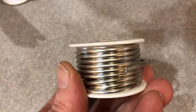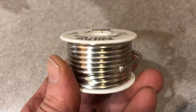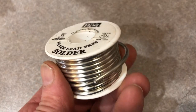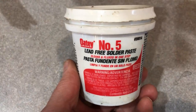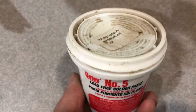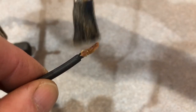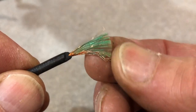As solders go, it's not very strong and it contains lead. Here is some lead-free solder. This is often used to solder copper pipe used for plumbing in buildings. The lead-free part is important, as the lead in leaded solder will slowly leach into the water flowing through the pipes. This solder is also stronger and has a higher melting point than leaded solder, about 422 degrees Fahrenheit. One drawback to lead-free solder is that the correct flux contains acid to help strip the metal of oxidation at the higher soldering temperature. This works fine, but it must be cleaned off after soldering, or corrosion from the acid will result over time. But never do this: solder wires with acid flux. It makes a nice solder joint alright, but the flux is now leached into the wire, and over time the wire will corrode invisibly from inside the insulation.